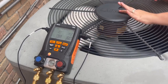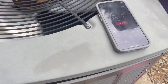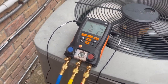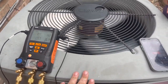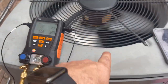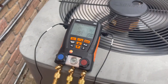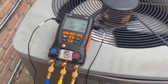Now I'm going to go in and bring them their invoice, and they're not going to be happy about that because four plus four is eight pounds of refrigerant — you can imagine what that's going to cost them. They're going to have to at least replace the air handlers. I already know these systems leak. I've already found the leak in both air handlers, so I know it's the evaporators. Air handlers need to be replaced.